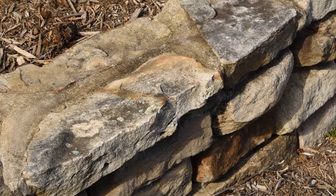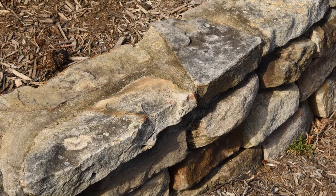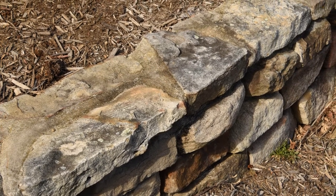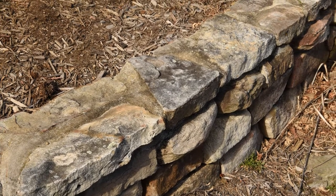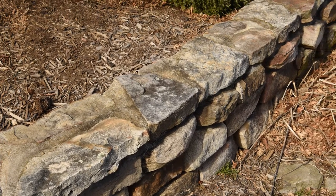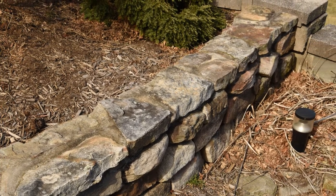The finished wall. Because water behind the wall can easily drain off to the side, drainage holes were not installed in this wall. In addition, cement block, including Ivany block, is extremely porous. The backside of the wall was sealed with a waterproof cement product.